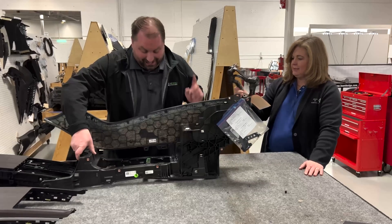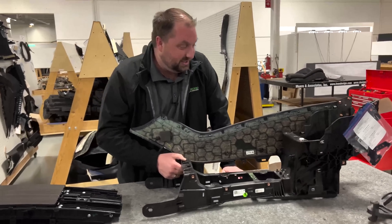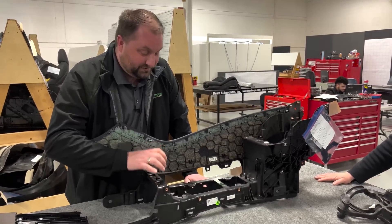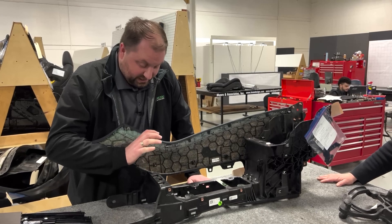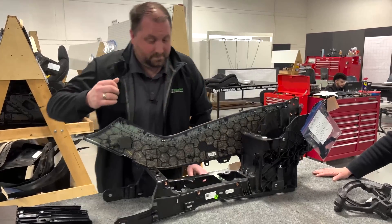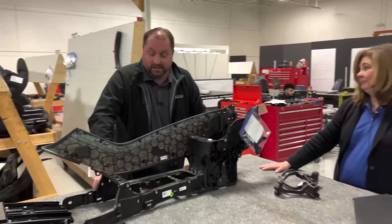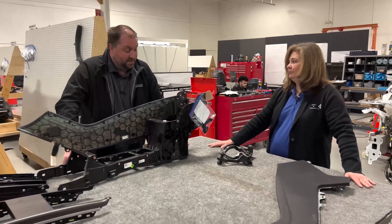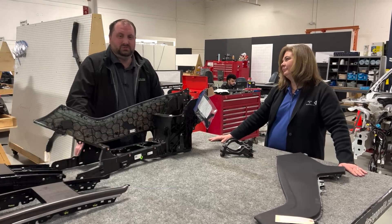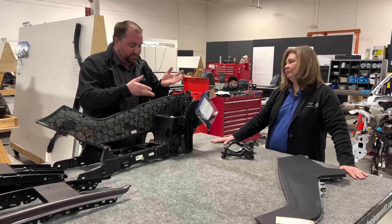This piece right here was exciting to me when the other members of the team pointed out that they had looked at what its material call-out was. This is an injection molded nylon part, but it is carbon fiber reinforced. Why would you do that? That was a question that came up many years ago. I did my thesis on injection moldable carbon fiber. In a sense people would say, well, that's throwing pearls before swine. Why would you take something that is that expensive and just use it chopped up inside of an injection mold?